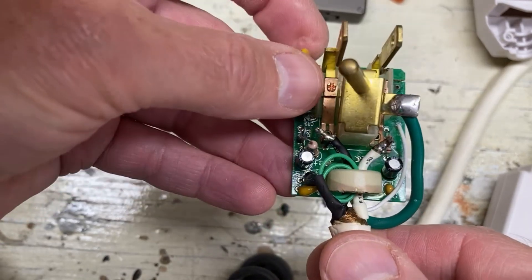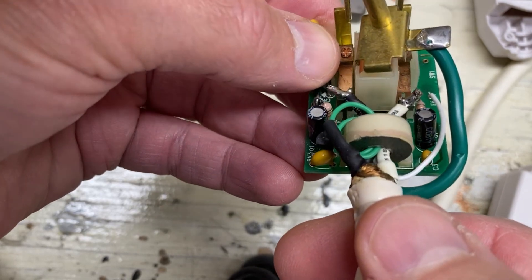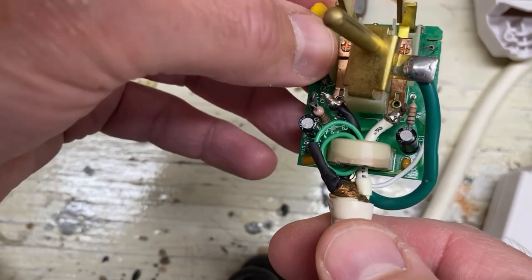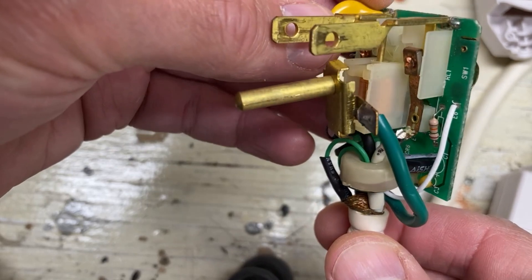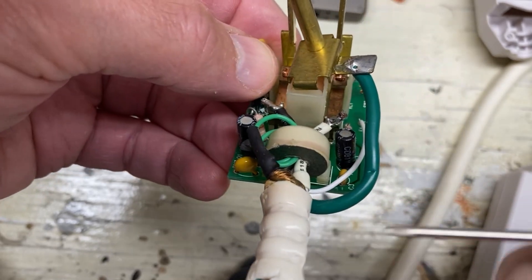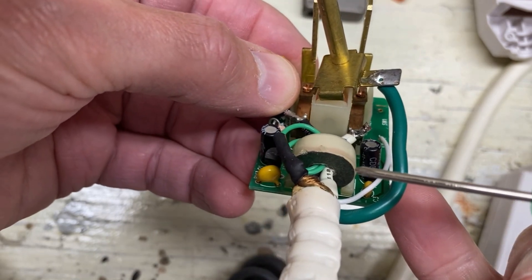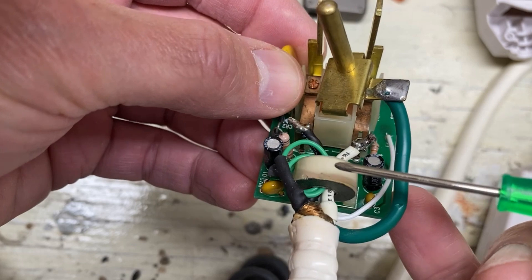This little device — and this is where electrical engineers and the astute among you can obviously see, like I did, what's going on here. There are two major components which I think contribute to the behavior of the GFCI outlet. First, you have to sense the difference in current.